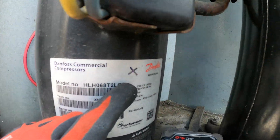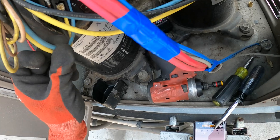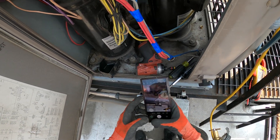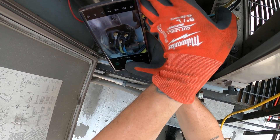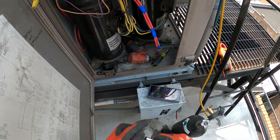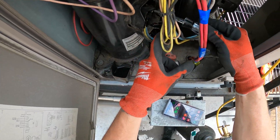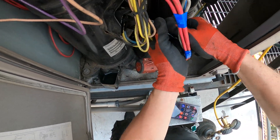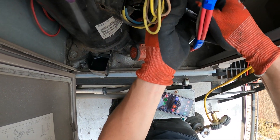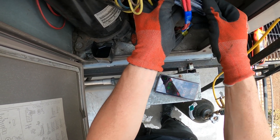I know this is number one - I think it's actually labeled. There's an X on it, so I guess that's for this contactor. These connections look good. Let's take a picture of where they go. Now let's take off each terminal and meg this - let's see if this compressor is even good. I'm assuming the low pressure control saved this thing. Let's use a basic meter for now and isolate this compressor.